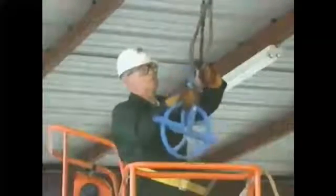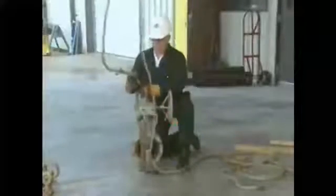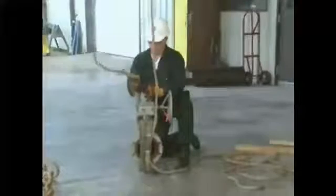After you've thoroughly inspected the equipment, the next step is to select an overhead support from which to hang the block. The support structure must be able to support the weight of the load, the block and tackle, and the force you'll exert to lift the load. In this example, the support hook is used to hang the block from the structural beam in this covered work area. Once the block is securely hung overhead, attach the load hook to the load.